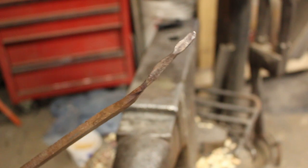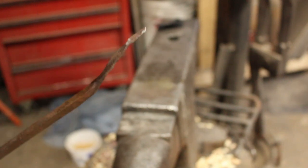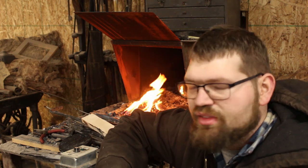I'm a little out of breath, but I think we can say that we gave it a fair try. Again it's discolored and we really drew it out, but I don't think I saw any glowing color on it. So obviously this technique works with ferrous metals — iron, steel, even stainless steel. It seemed to work a little better with stainless steel, and I'm guessing it's because of the other metals mixed in to make it stainless. I think those metals work a little bit better at cold temperatures without cracking, and that's why we had a better result.